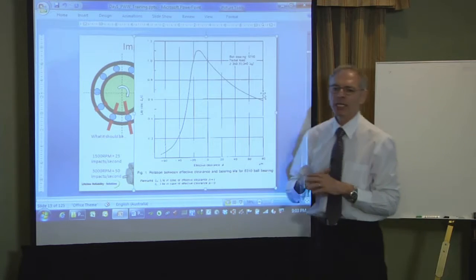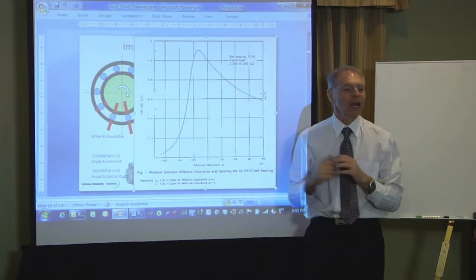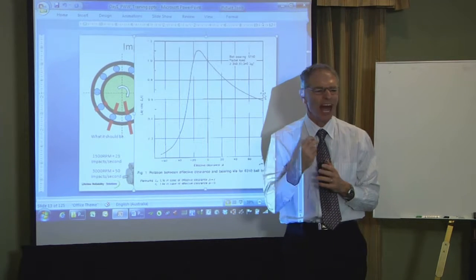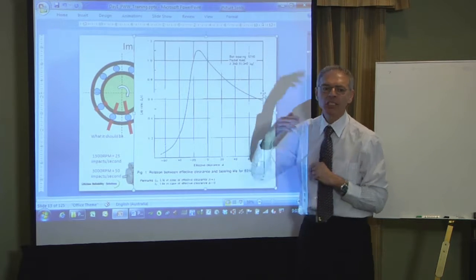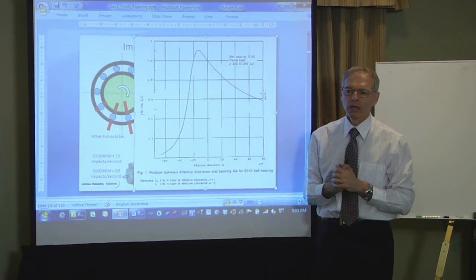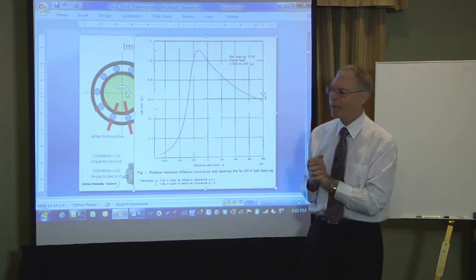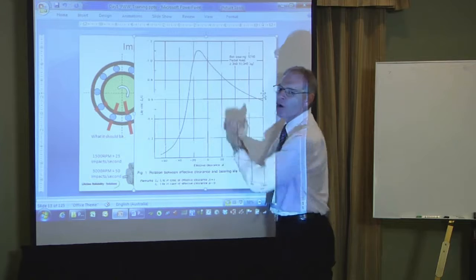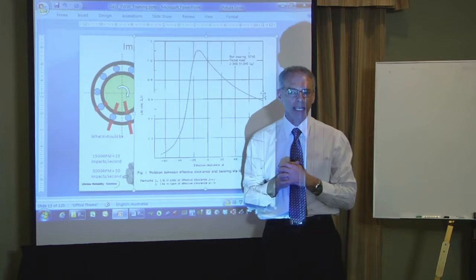So when it comes to machines with bearings, I have about 10 microns, 15 microns to play with. I've got half a thou to play with. And I've got to be in this zone here for the entire operating life of that machine. Now I've got to build a process in my company to make that happen. I've got to make sure that every single bearing is in its zone for full service life, and we do that on purpose, not by accident.